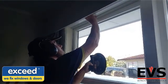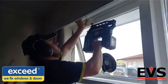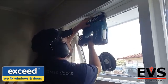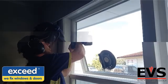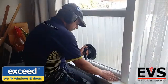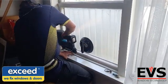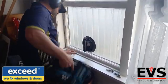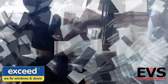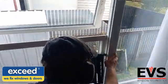The next project are the windows with split profile double opening sashes. These will need their hardware removed and the inside rail trimmed at each end to make room for the profiles to be fitted. Andy uses a suction pad to hold the window closed so he can fit the seals into the correct position. The process is similar to the door installation by starting with the head and moving around the rest of the window frame.